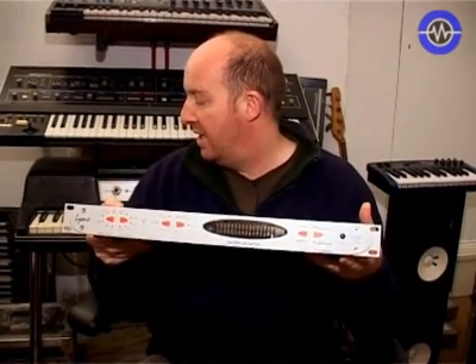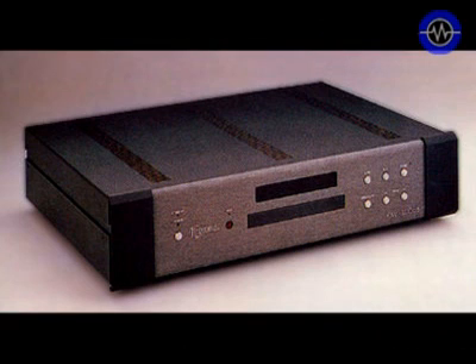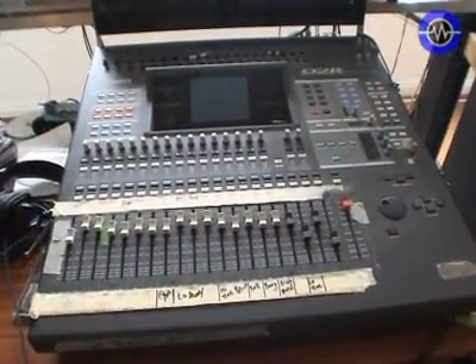The 8-channel version is about $2,500 and around £1,599 in the UK. For our listening test, we took a Krell KAV300CD up to the Goldfrapp studio. We took the S/PDIF out and fed that into the Yamaha O2R digital input, then took the analogue out and fed that into the recording interfaces one by one, returning via ADAT into the O2R's ADAT slot. That way we could A/B between the two sources — the only difference being the actual A-to-D conversion. The monitors were Goldfrapp's ATC SCM20s: very clear, very good stereo imaging, and a system they're extremely used to.